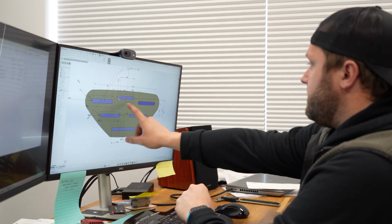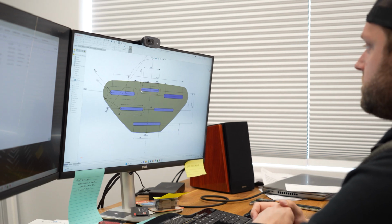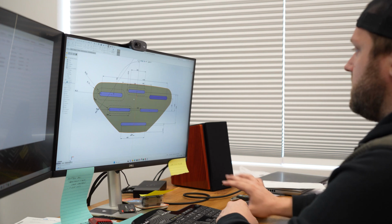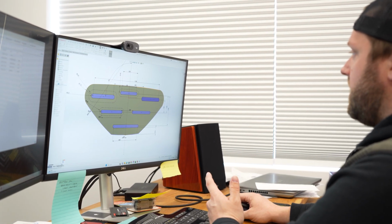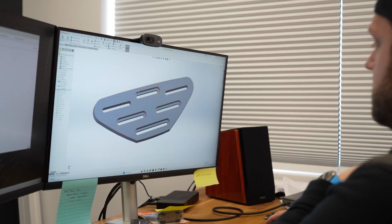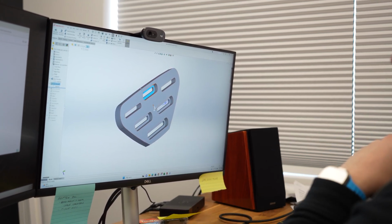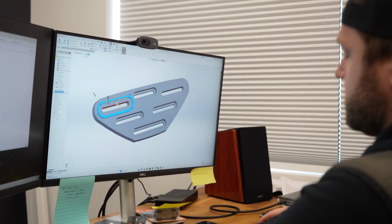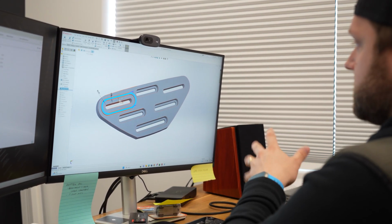And then we added 4 mounting slots here, which would be to mount this piece to whatever it is you're attaching it to. You'd have some adjustability up and down to accommodate that bar being in a different spot on the bulkhead depending on your truck. And then if you're on a MOLLE panel, the same would apply. So the next thing I did was cut these reliefs in here so that the hardware you're using to mount this to whatever it is recessed, and also so you're not bolting through like a 1/2 inch of plastic here. Then we put this ring. This mimics what MaxTrax has a little bit, which kind of provides a flush mount surface for their pin. So I'm mimicking that so that's nicely integrated.